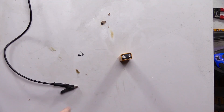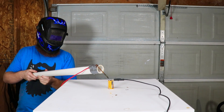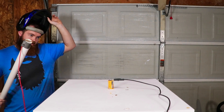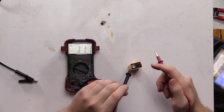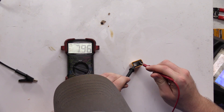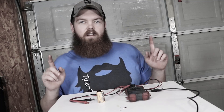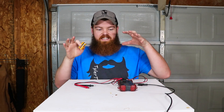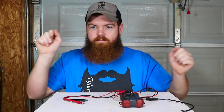So let's touch a little bit longer and see if we can get up to eight, eight and a half, maybe nine. Let's go like three to five seconds. Three, two, one. Well, that seemed a little bit extreme. Let's check the voltage now — seven point nine. So it's kind of what I expected: you can put a little bit of juice back into it, but not that much. I can hear the comments now — I know this battery is not rechargeable, and people are going to say this only didn't work because it wasn't a rechargeable battery.